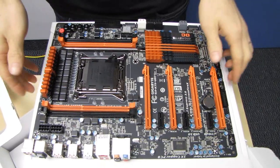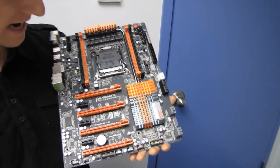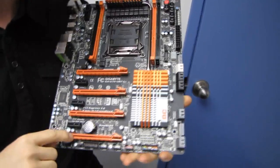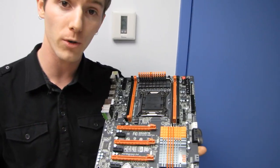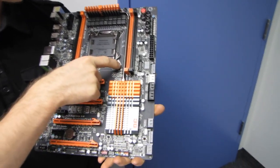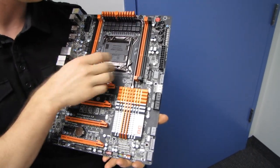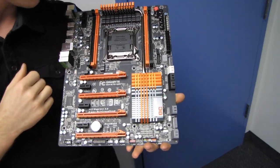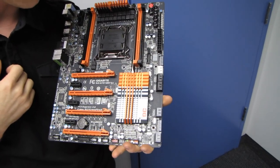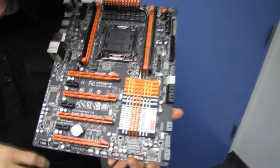Let's start with the overall layout of this board. This is an XL — that is to say extra-large — ATX motherboard. It has seven expansion slots, which is very difficult to do on a regular ATX X79 board for a couple of reasons: one is the extremely large CPU socket, another is the extremely large and robust power delivery systems that typically exist on these boards, and the other is the fact that memory now goes on either side of the socket as per the Intel recommended design.